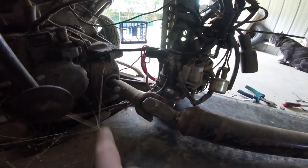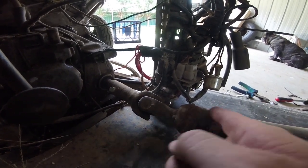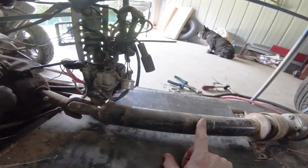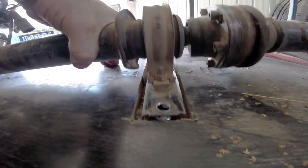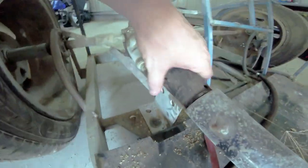I've had a few people ask me how exactly the drive system works on this mini rod that we've built, so I'll take you through and show you. Basically this bit here is part of the original drive shaft that went inside the swing arm - that's what I've cut somewhere in here and adapted it to a car's two-piece drive shaft, then just machined up some metal to adapt that size to that size and welded it together. So that gives you the first joint. I've got the center bearing there - just unbolted - goes down into here, so that's part of the original swing arm as well, which I welded a bracket off the bottom there, which I've just unbolted, which holds that in place.